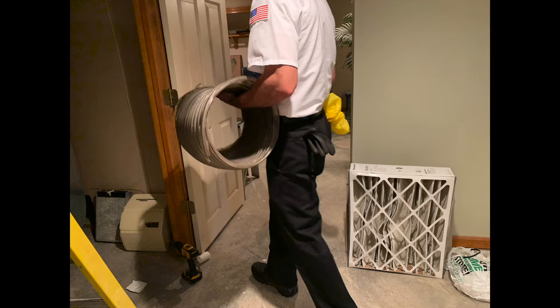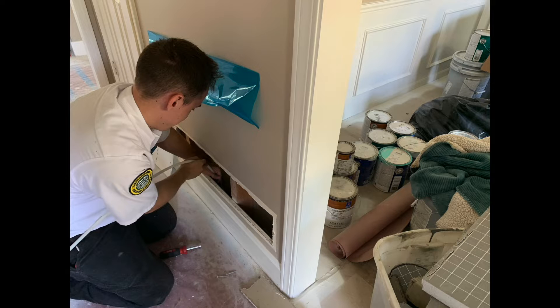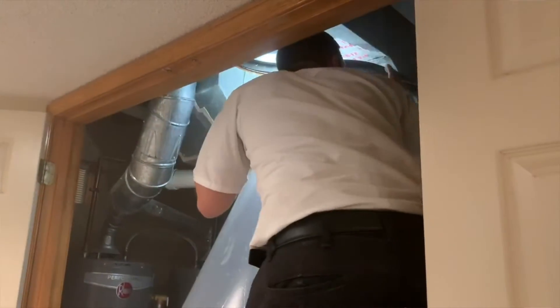We do a pre-check to measure whether the duct system is leaking and how much — we get a hard number. The sealing process itself takes about 10 to 15 minutes, but that's after hours of prep work. We go in and completely plug up your duct system and measure it. Then we first do hand sealing — we have a duct sealant in a bucket or caulking gun, and we manually seal the big things we can see, especially down in the basement. You can spend a couple of hours painting sealant over joints and sealing by hand first.